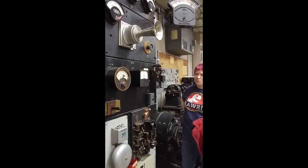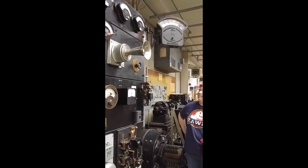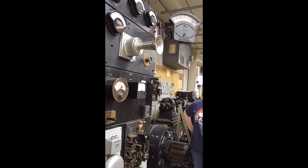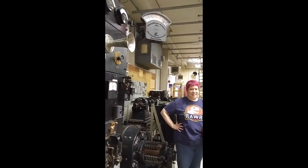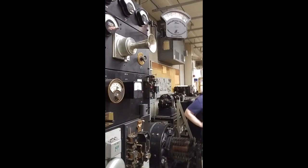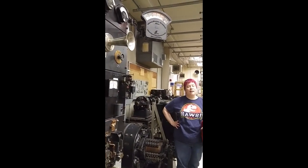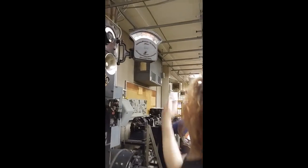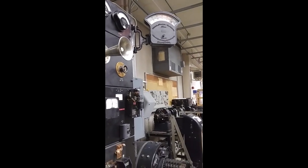The main bus out is 48 volts DC. All your power would come through here. They still use 48 volts DC to this day — it's actually negative 48 volts DC to prevent corrosion. We're running a little bit high right now, about 52 volts. It's 48 volts nominal.